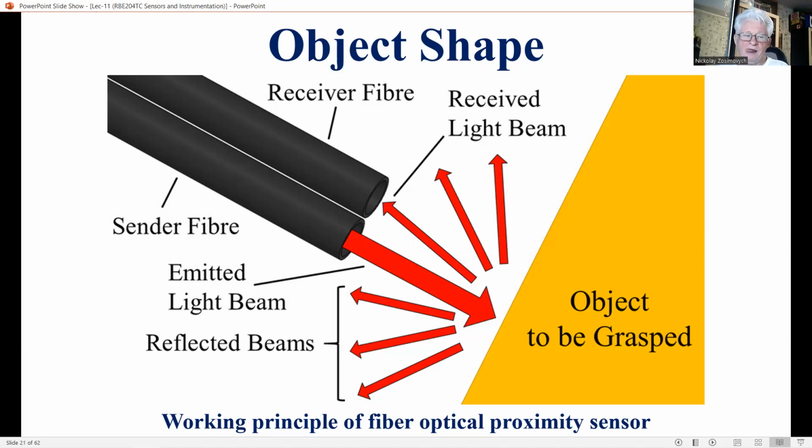The transmission mode is the most simple and effective way to control production processes and to monitor the dimensions of a product. The applicability of the method is almost unlimited. The aim is the online determination of the rotor blade diameter up to several meters with an error less than 10 micrometers. Light source and detector, a quad photodiode, are positioned just at the outer edge of the blade. A small change in diameter modulates the transmission, yielding information about the error.